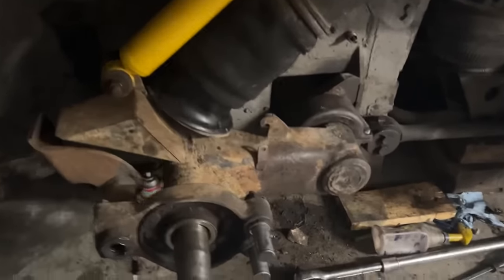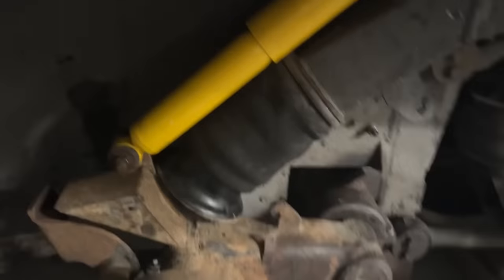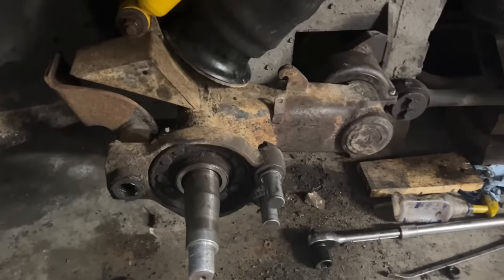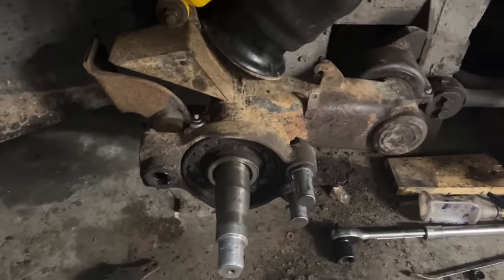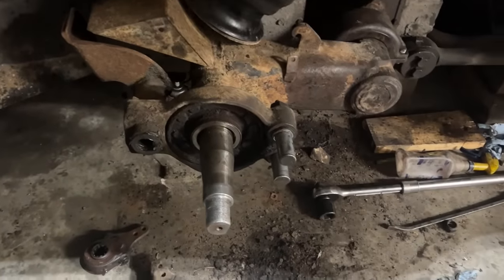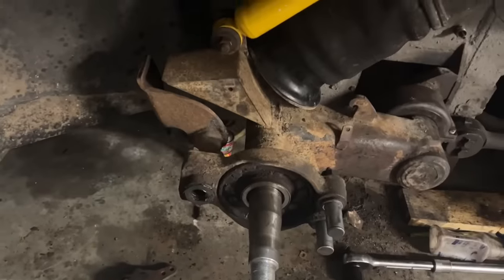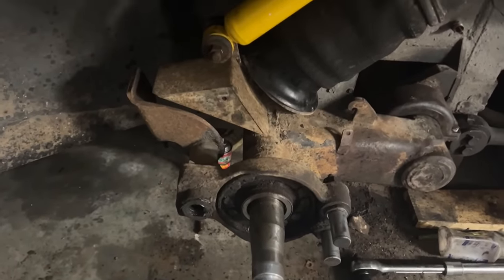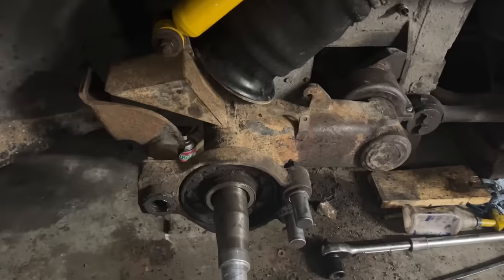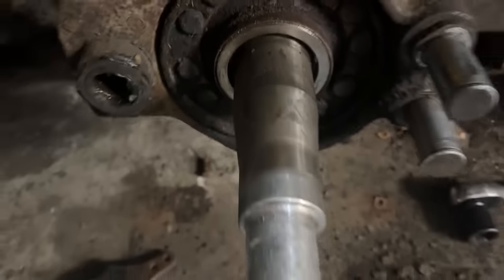Okay, so we have the new swing arm all attached, everything ready to go there, hooking up all the new accessories, and we're swapping things over, like the brakes. He had brand new brakes on the other one. We're keeping the same drum. We had to swap out the one anchor pin there. We're using his brake chamber because we know it's a known quantity in good condition. So we're getting this all switched around here, just a few minutes of work, but we now have a very good spindle. If you remember the one that we had previously,